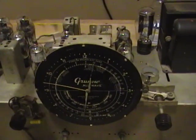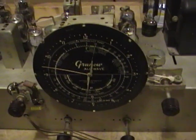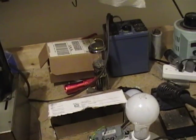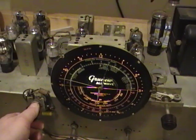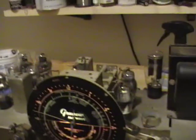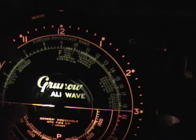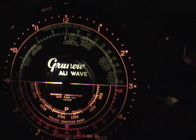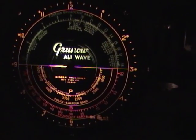I've got the bulb back inside the shroud. Now I can finally see what the illuminated dial face looks like — that's pretty cool. Different colors: the top part's green, then we've got yellow, then red. I've also plugged the radio directly into an outlet rather than going through the dim bulb tester, because even with a 150-watt bulb it was limiting the juice to the radio a bit. When you change the bands, I thought it might illuminate different sections, but they're always all illuminated — you're just supposed to figure out which dial position is which band.